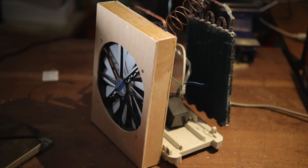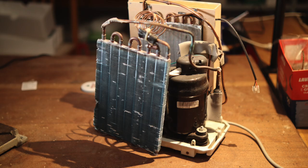But today's project is also relevant for the winter: a heat pump for active heat recovery for fresh air. I dismantled a dehumidifier — this is an old one — and will recover heat from outgoing air and pre-warm incoming air. This means better air quality in your house without cold drafts.